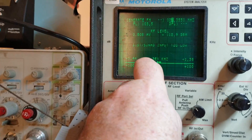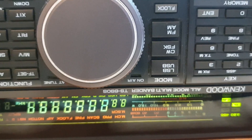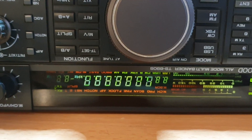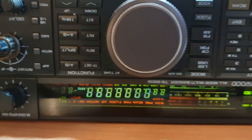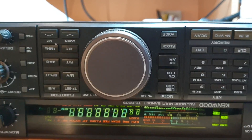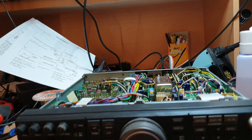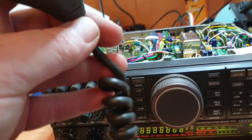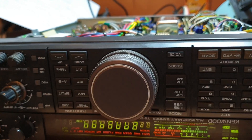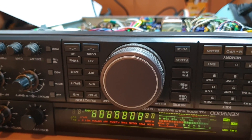Let's go back to putting 0.5 microvolt through — so it's hearing 0.5 and have a look at that: 2, 1, 2, 1, 2. Now something else is happening there — the box has got a little bit of an issue. Let me have a look at the rear of this connector and the mic. Sometimes you've got to sit there and move things around and look for it. Two things could be happening: mic cord or VOX. We'll turn our VOX gain down and find out if the VOX is on permanently.